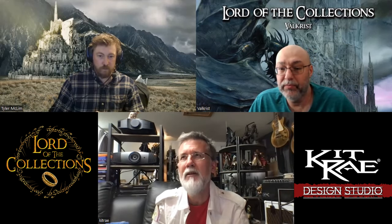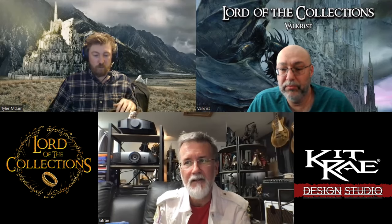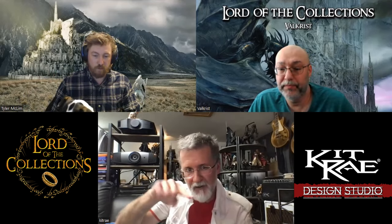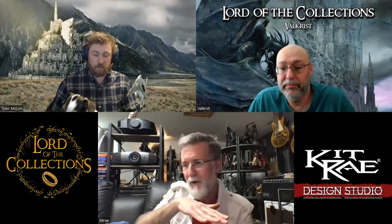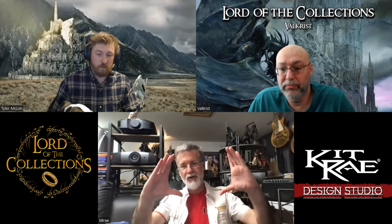Probably the most visible difference you can see on almost every blade is the depth of the hollow grinds and the fullers in what Peter made versus what United made. He can get a much smaller radius on those linishers and get those really beautiful curves in those blades, and they just reflect light beautifully. We're less than half that on the radius. We're stuck with grinding wheels in these machine grinders, and the smallest wheel we can get is about that big.